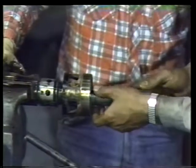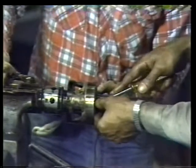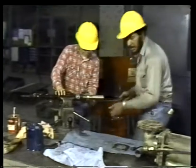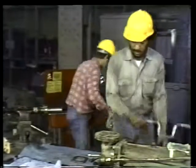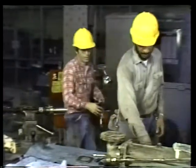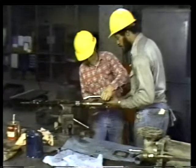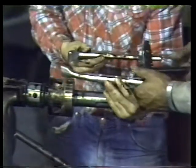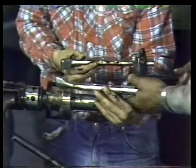Before the mechanical seal can be removed, the bearing must be taken off the shaft. First, the split retaining ring which holds the bearing in place must be taken apart and set aside. Since the ring is split, remember to keep both halves together. Then a bearing puller can be attached with its jaws gripping the seal plate and stationary face of the mechanical seal. We want to apply pressure to the seal plate rather than the bearing itself in order to minimize the chances of damaging the bearing.